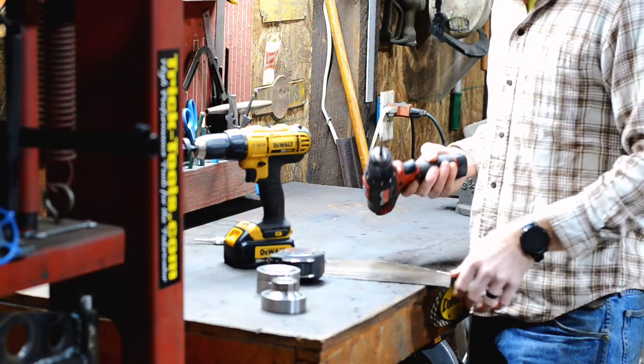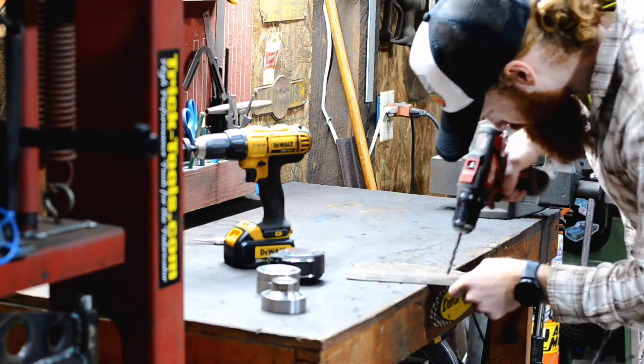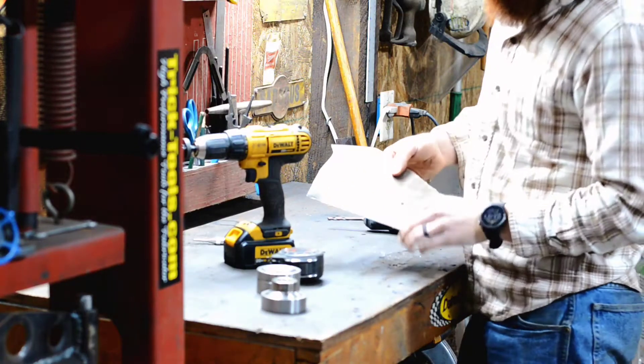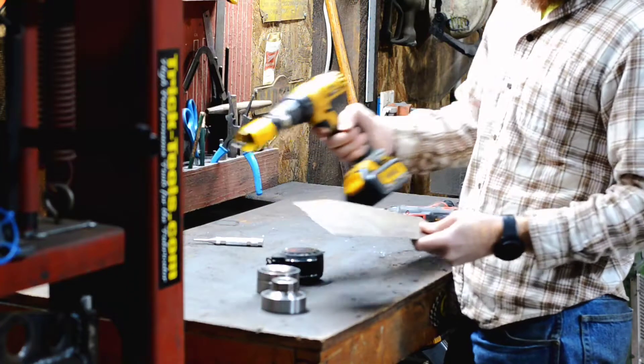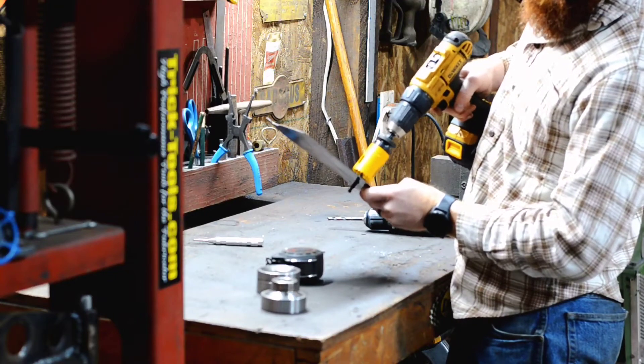So that's the first thing I'm going to do — get this quarter inch hole through our sheet metal. Now that we've got that established and it's a good hole for our hole saw, we're going to be able to go in there and use that as a guide.